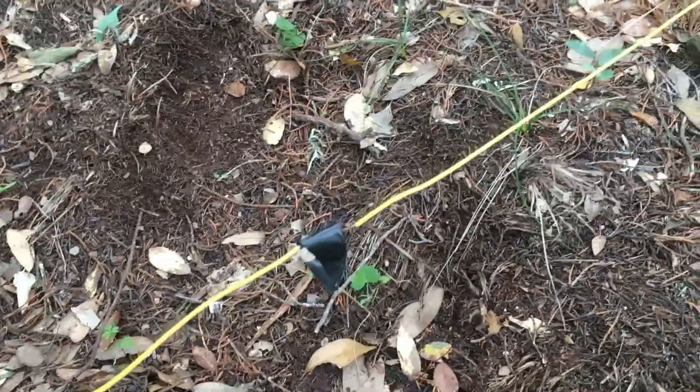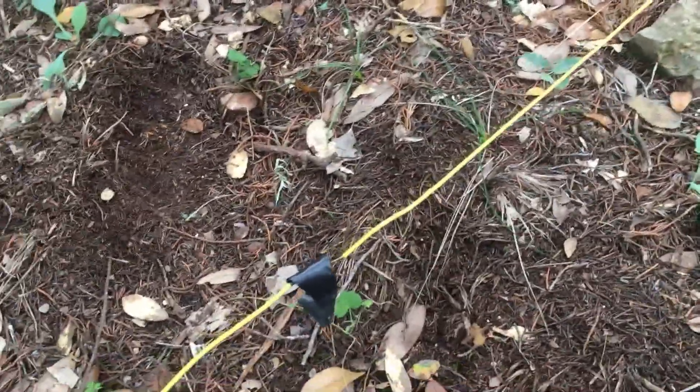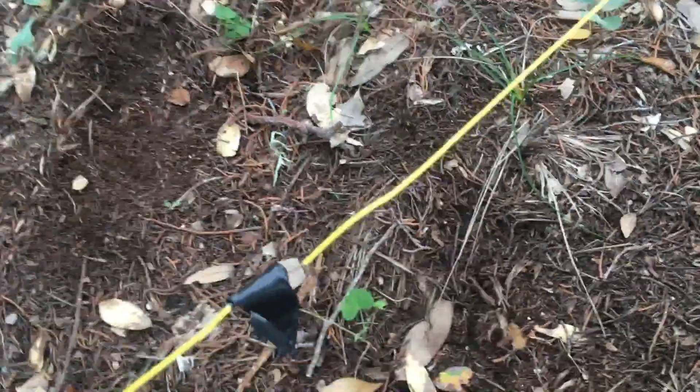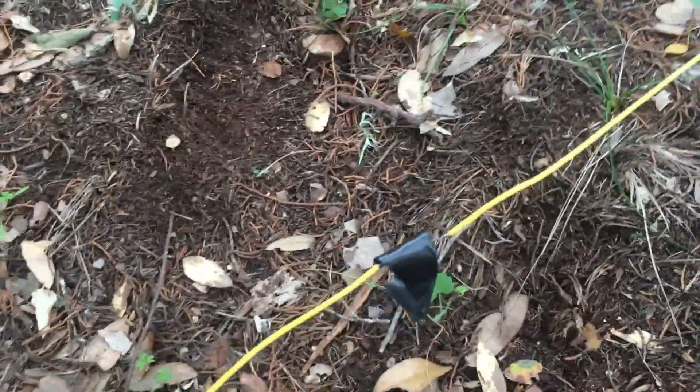There are a bunch of different ways you can do this. Basically, I have a short section here where the other wire is just right across there, maybe 8 feet away. I'm running a wire between the two, stripping some wire off, and connecting them. If we get a signal, it means the system is broken to the left of us, somewhere down there. If not, it's to the right of us.